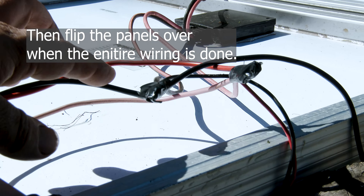Now we are working on the power inverter. This is 500 watts, so it will run a few small things. There are screw terminals on the back of the power inverter. Run a positive red cable into the positive section on the power inverter, then run a black negative cable on the power inverter's minus terminal. Make sure positive is the plus symbol and usually a red cable as the identifier, and the negative is the minus symbol and black cable.